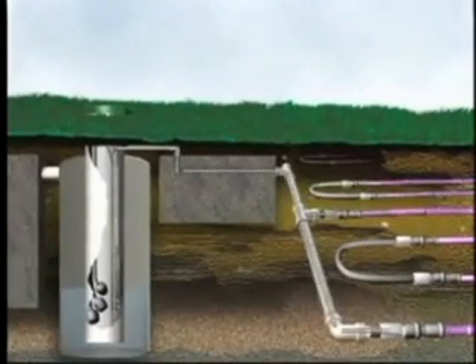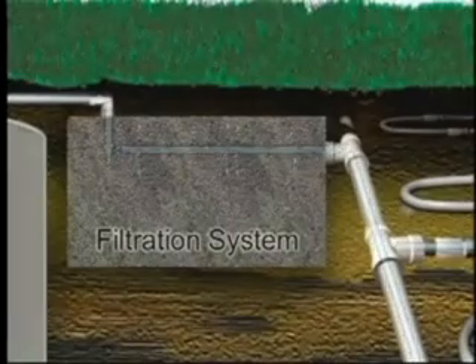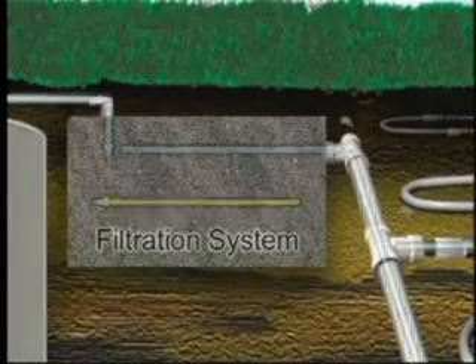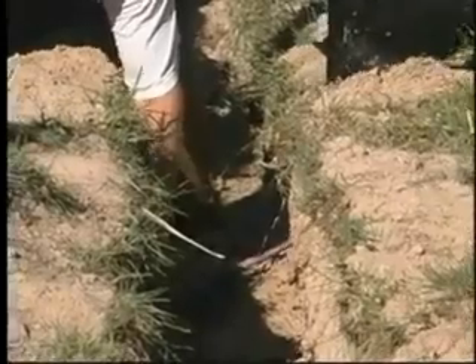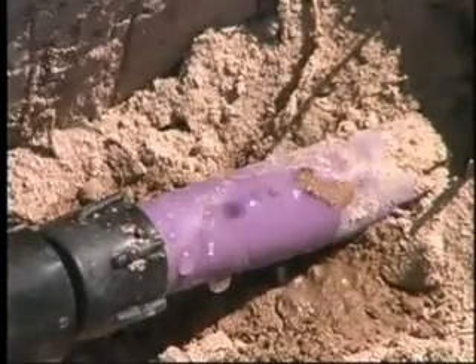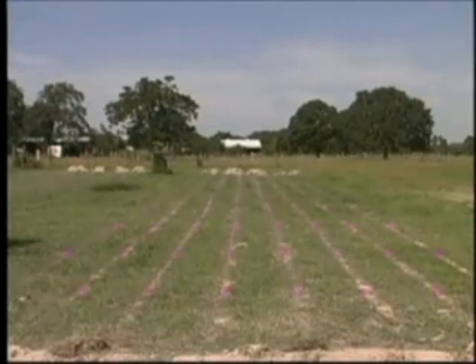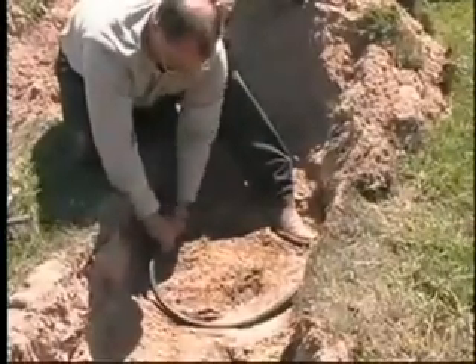The pump tank stores the wastewater until the controller turns the pump on to dose water into the soil. The filtration system removes the large solids from the wastewater and flushes the solids back to the pretreatment device. The drip tubing is placed directly into the soil without the use of media filled trenches. The system relies on drip tubing with emitters to reduce the water pressure before it enters the soil. Since the emitters in the line have the same emission rate, wastewater is uniformly applied to the dispersal field. Tubing is placed approximately two feet apart so the emitters are on a grid pattern, and the drip lines are buried relatively shallow so the soil can provide treatment and landscape plants can use the nutrients and water.